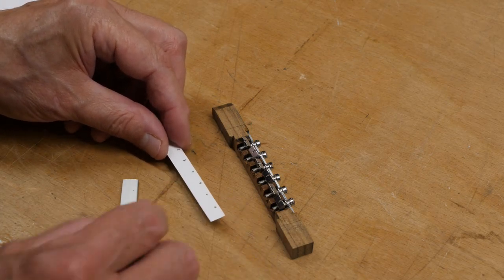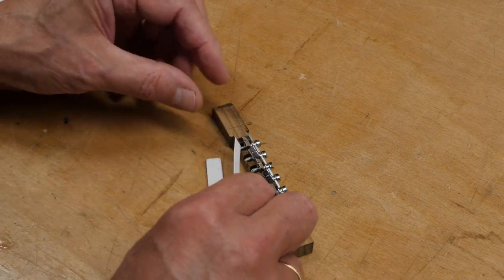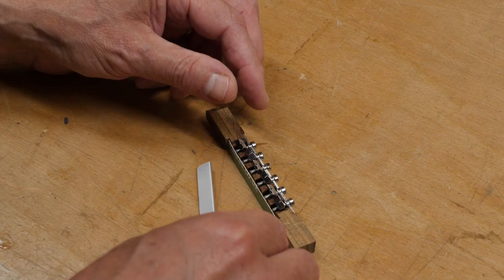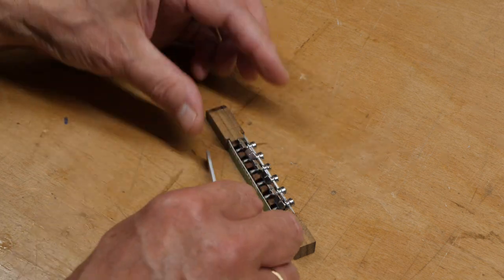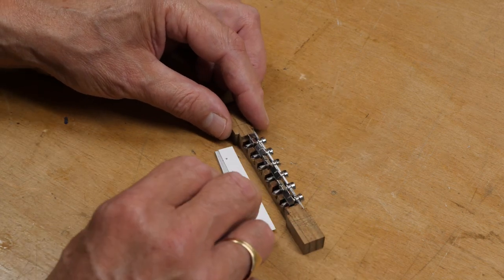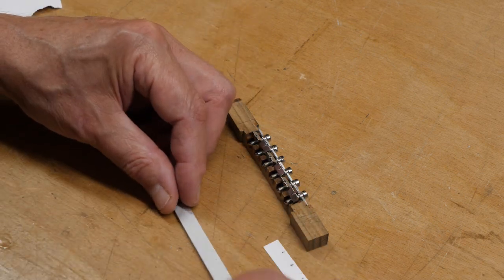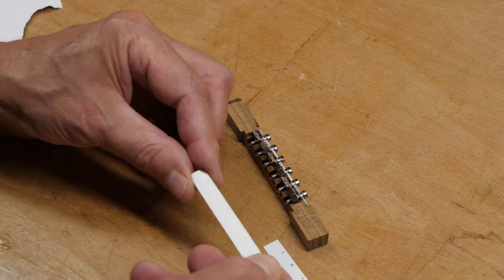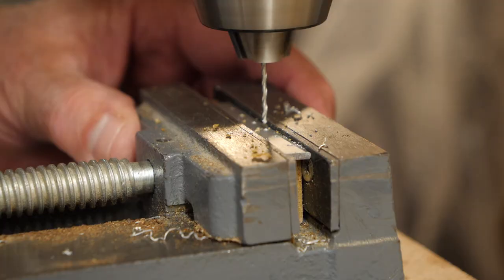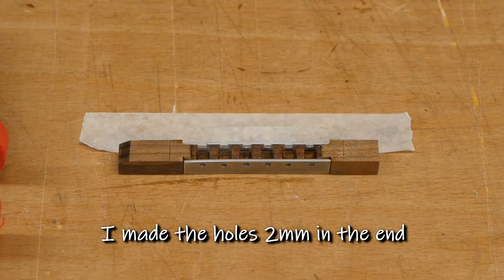Now to get the holes on this side of the bridge - what I've done is I've got a bit of cardboard and I've actually pressed it against the pins on the end of these bolts with the bit of metal in place, and then I've marked through. That left an indent which I could just see. I've then marked through and marked the holes onto the aluminium. So I'm now going to drill them with probably a one millimetre hole to start off with.